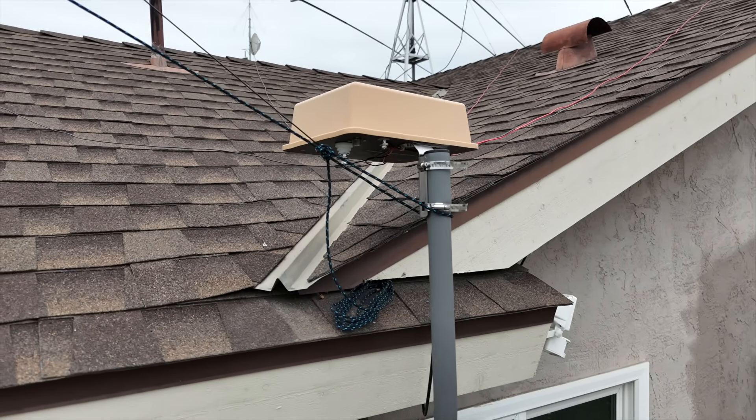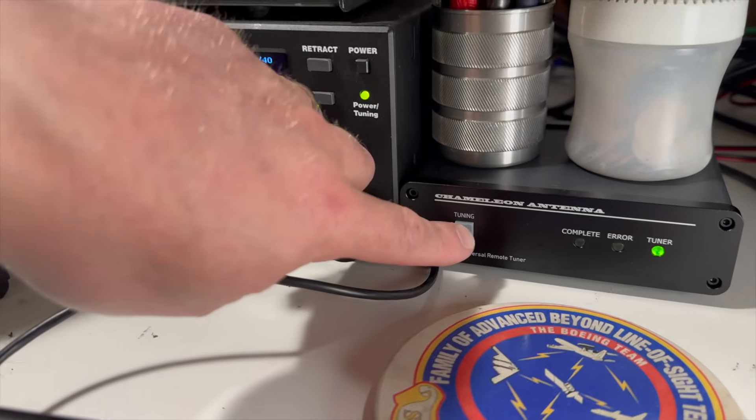This has given me the ability to go from 80 meters all the way up through 10 meters. Having a nice 50-foot long wire at the highest point is a nice thing to use and switch to occasionally. I've gotten back to 80 meters, which is a band I have not been able to use for a really long time. The goal of this video is to talk about this tuner and demonstrate it with my Flex Radio, show how to use it and how it functions. It has memory channels that remember its tuning setup and relay adjustment for any given antenna. There's a little control box that puts 12 volts down your coax, and when you click the button and apply tune power, it jumps through its relay options until it finds a good impedance match.